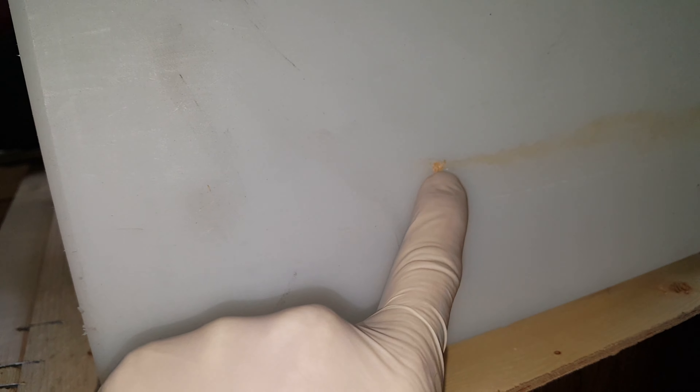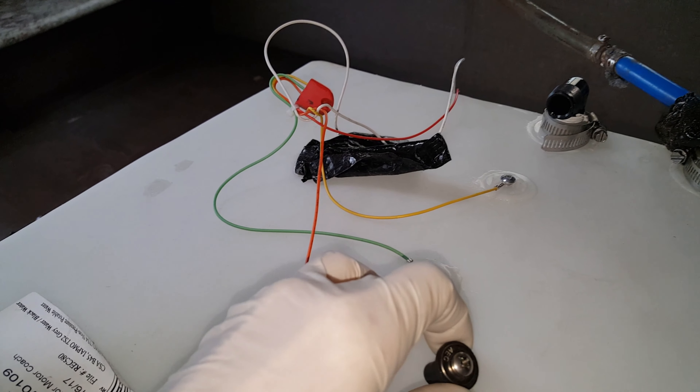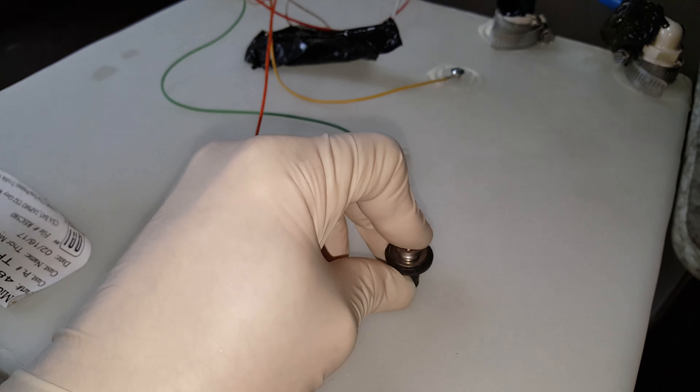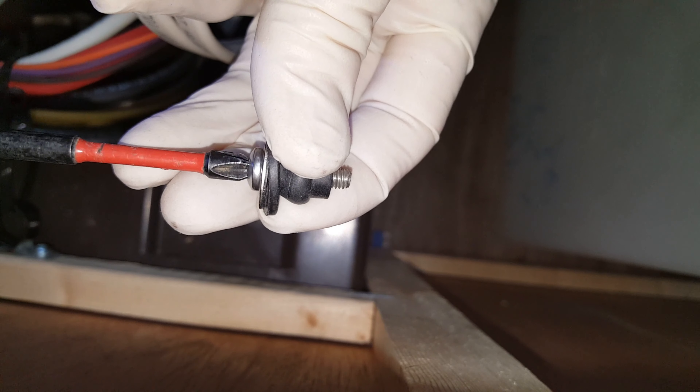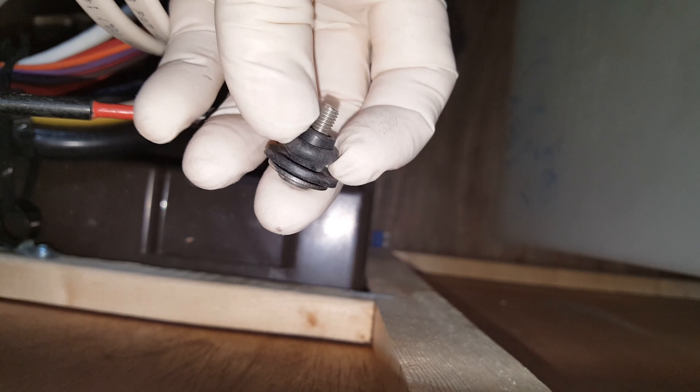There are two ways of fixing this. We could plastic weld it, but that's not always a good guarantee, especially since this side is going to be flexing quite a bit. The method I like to use on a little hole like this is a well nut. Generally these are used as fittings for tank sensors. You drill a three-eighths inch hole, stick it down in there, tighten it up, and as you tighten it, the rubber back bunches up and actually seals the hole.